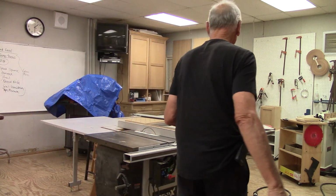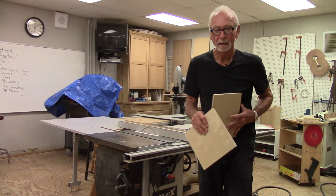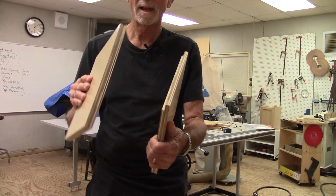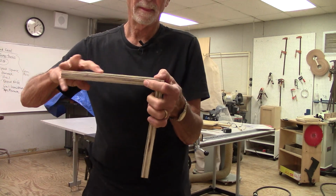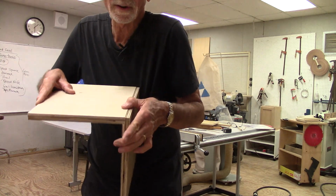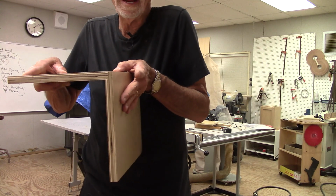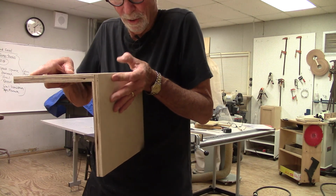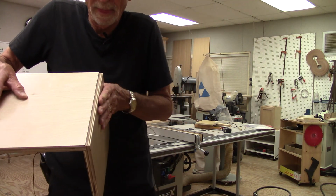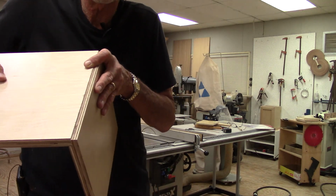And that rabbet joint will allow us to take a square piece of stock, put it on the joint, put it on the shoulder of the rabbet, right? So it's flush right here. It's sitting on a shoulder. So you have nailing from here, and you can also nail down into your shoulder. It's a great joint, and it's got better glue surface than just a butt joint.